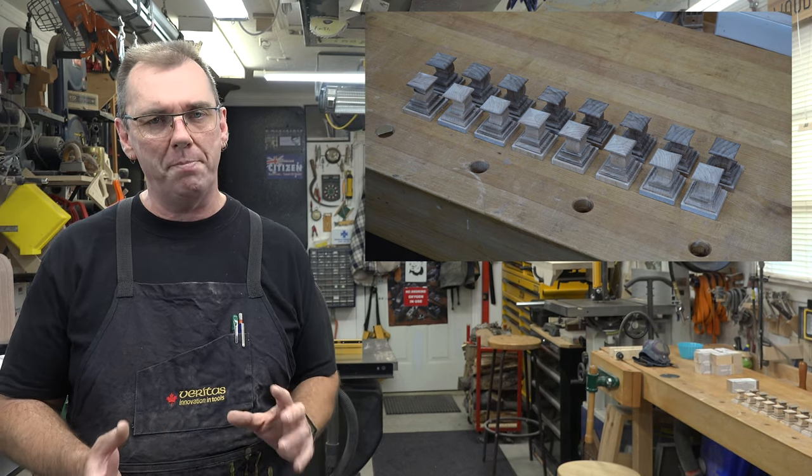The reason it goes slower or faster is depending on where the cuts are situated. You're now cutting this way. So in essence, you're cutting less material, so the blade is going to cut more quickly. So just be careful of your blade control, not to have too much pressure into the blade, because you could really ruin the inside cuts there. So there you go. That's just one thing you want to keep in mind. And now that I have said that, I'll carry on with these cuts.